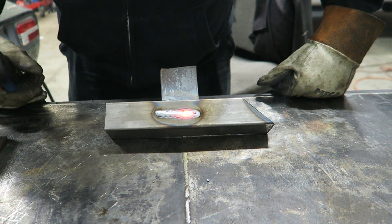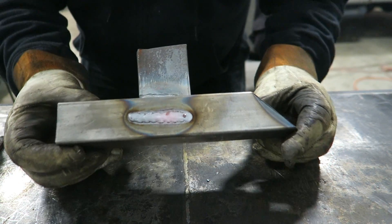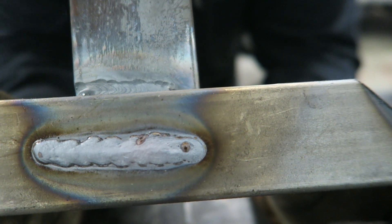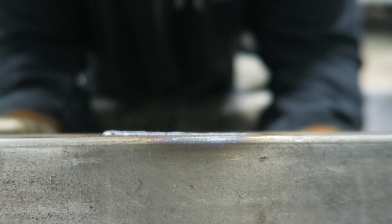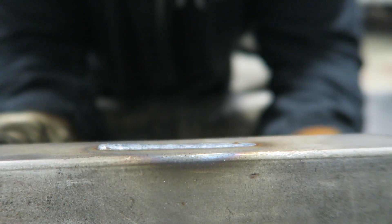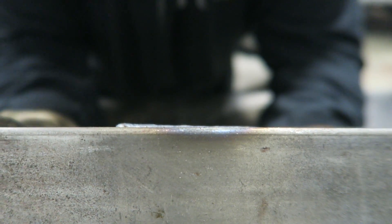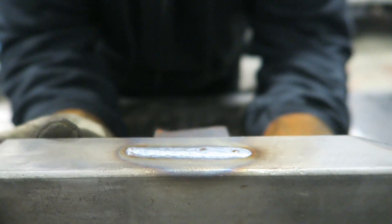Actually not too shabby for having welded in a weird direction, but you can see at the very end of that weld it sunk in. In my honest opinion this is too much heat - you can kind of see how the weld started out high and started sinking lower and lower, and that was even after me increasing my travel speed. I would personally turn the voltage down a little bit as well as increase my travel speed to get that bead to lay a little bit higher on top. So let's do another one - we'll decrease the voltage a little bit and see how it makes out.